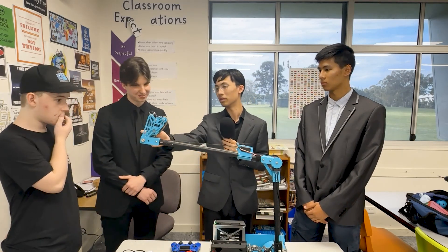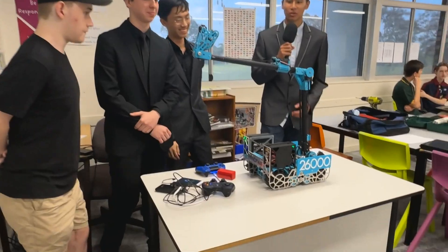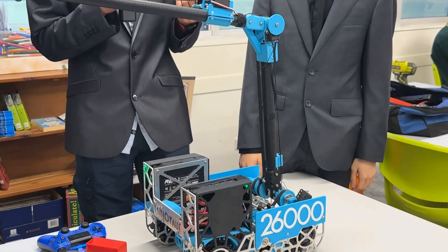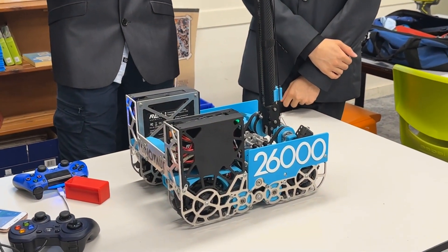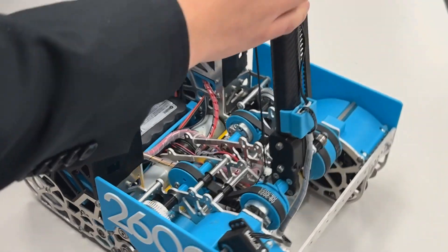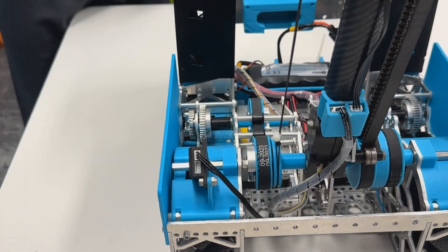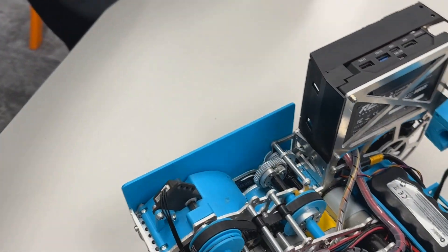Another very interesting thing is this wiring. Calvin over here can tell you all about it. So cable management is one of the most difficult things in FTC — you always see really spaghetti wires — and you can see on this robot here, it is all seamless. The way we first did this was with custom servo wires. With custom length, there are no points of error. We have wired this straight through our tubing and into our control hub and expansion hubs. This removes the risk of other robots catching on our wires and possibly disconnecting them from our subsystems.